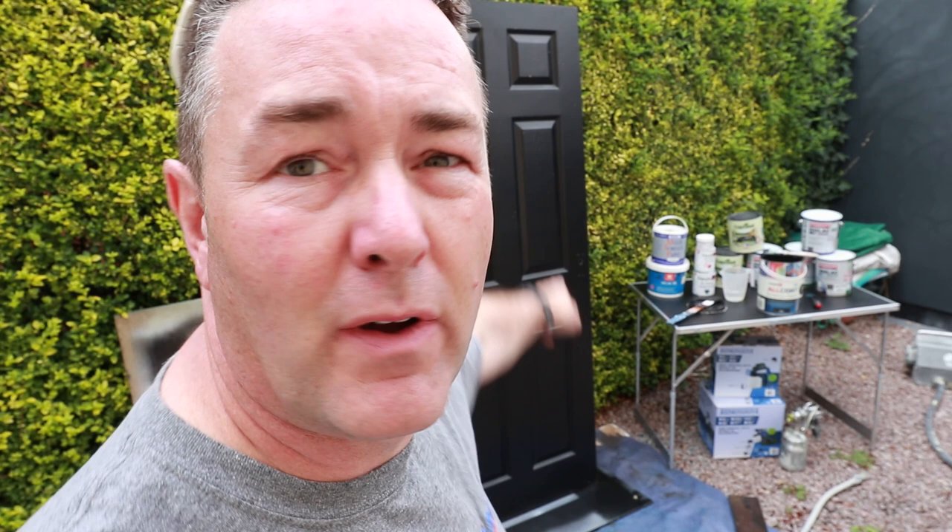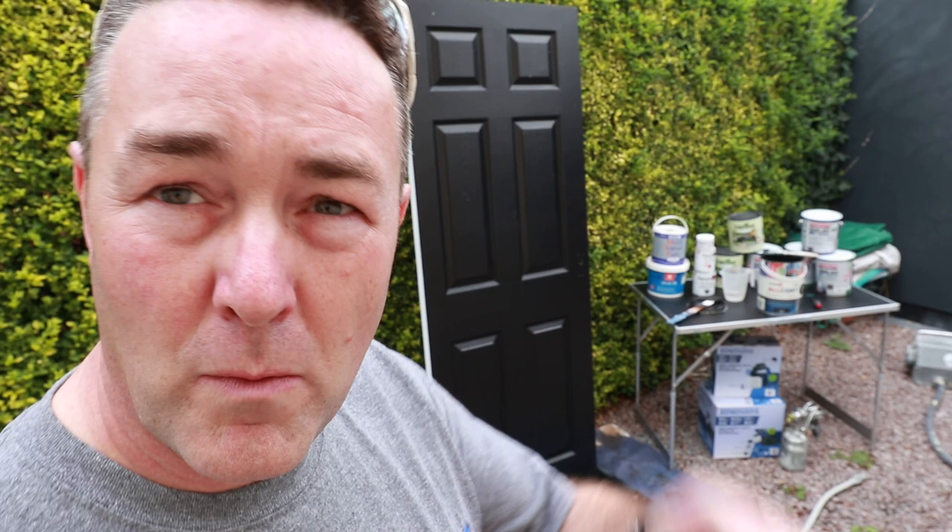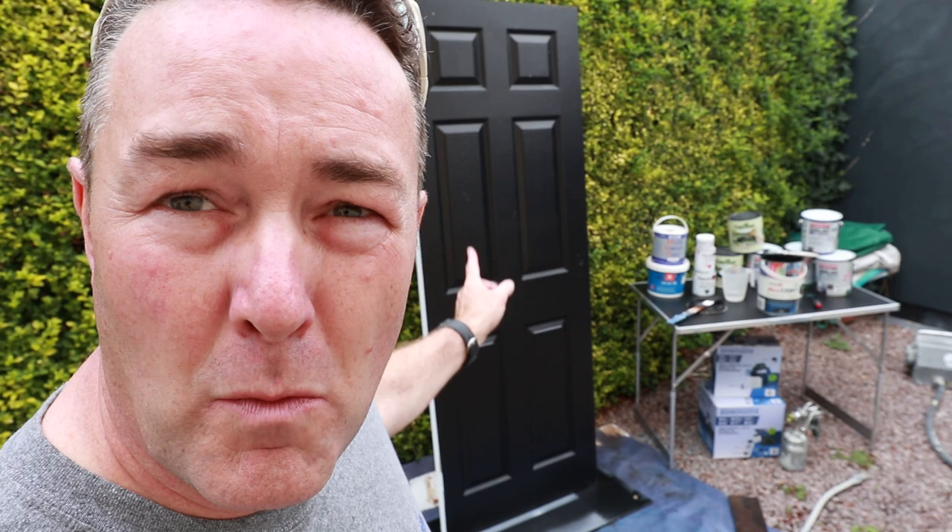While I was away, the door blew over in the wind and landed straight on the gravel drive — big chip on it, but it's not a customer's door so we crack on. Getting the sprayer up and running for the final coat. This time we're going up and down — vertical passes — instead of horizontal. Make sure your air caps are the right way around. As you'd expect, black has nearly covered already. There are a few misses — probably went a bit quick — but with HVLP it's not like airless; you've got more control. Take your time; don't go too slow or you'll get runs, but a slightly slower action than airless.